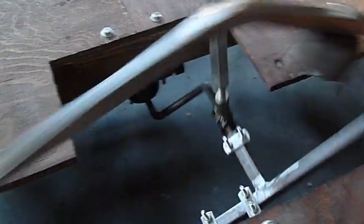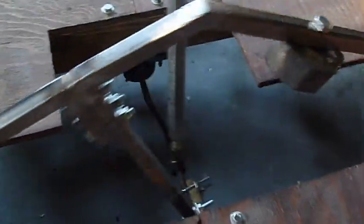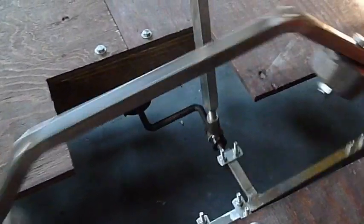I might also go from four to six of these blocks. But if I get it up to speed, this is a good flywheel — I'm happy with this. Because it actually takes effort now to stop it when it's moving. Right now I'm only pumping on the downstroke, and it's carrying itself entirely through the cycle without any problems. Again, this is with the Kalamazoo up on jacks so it's not a representative test, but I think this is going to work a lot better when we do a road test later in the week.